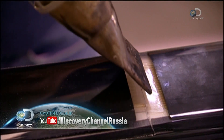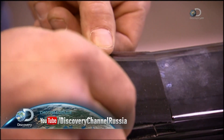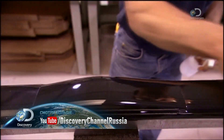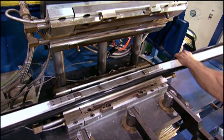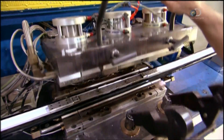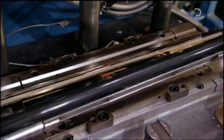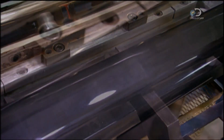It's covered with a piece of thermoplastic urethane, and again a heat gun is used to join the pieces. It's wiped clean with alcohol, then heated up in a mould for a couple of minutes. The splice section melts together, and then cool water hardens it. There's no seam line where the handrail loop could break.